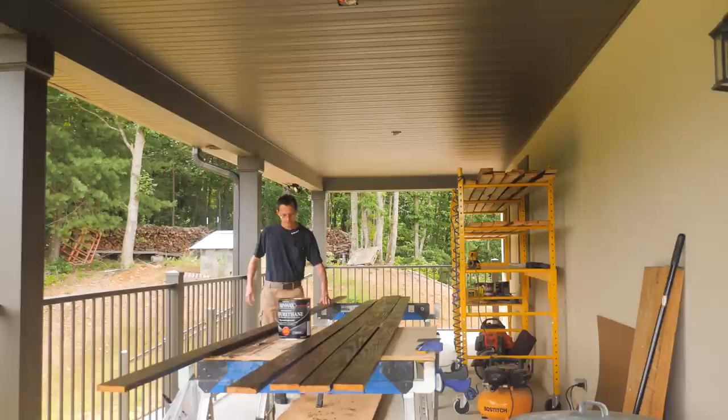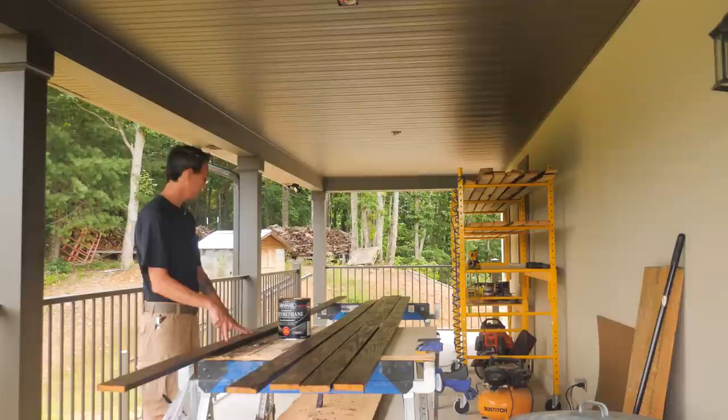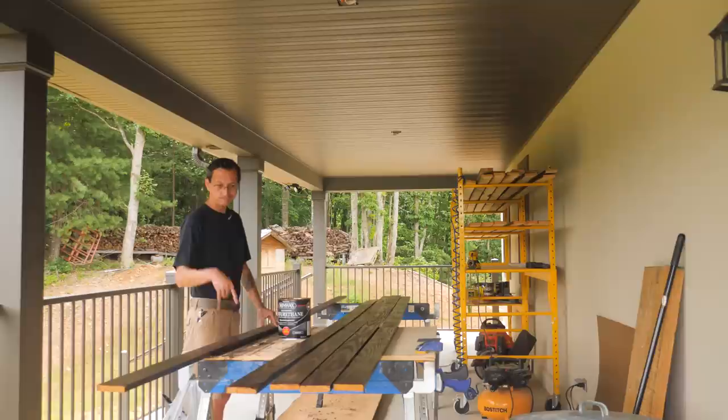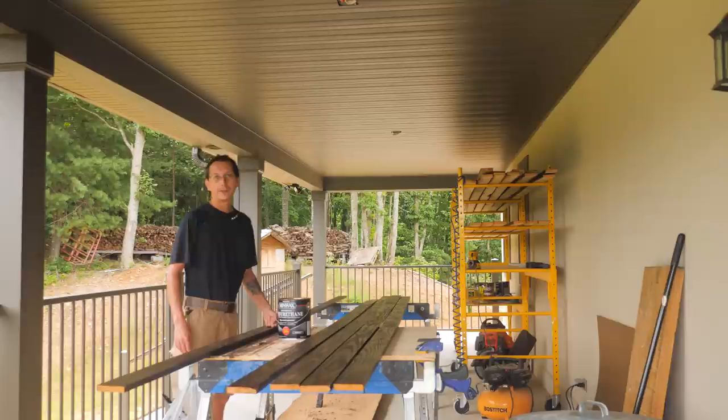All right, looks like this is dry. Put a coat of satin polyurethane on this yesterday. This is about 22 16-foot-long 1x4 southern yellow pine boards that I ordered from the mill and had kiln dried. So this was local pine. It was a little rough, so I had to sand it a lot and get it prepped, and it took a lot longer to sand, prep, prime, stain, and seal than I really had planned on. It kind of threw me back a little bit, and I worked on it in between doing a bunch of other projects, but got a bunch of stock here that I'm ready to do the door casing upstairs, and that's my goal today, to try and get all of the upstairs doors done.